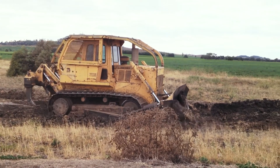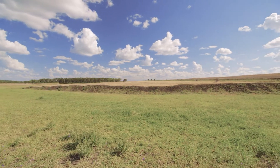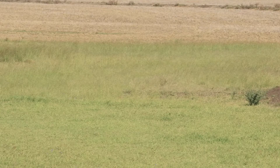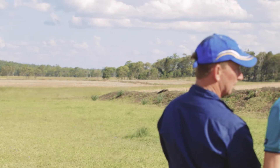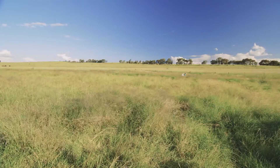To make this a success, after the dozer levelled the ground and made the waterways wider, I added pig manure with the spreader, spread grass seed, harrowed that in, put a fence around it and kept the stock off to get the grass established. I recommend these sorts of projects to all farmers to stop soil erosion further down the track, for future generations, to rejuvenate the grasses and better your land. We consider the battering technique to be doable, achievable and simple for most landholders and dozer operators.